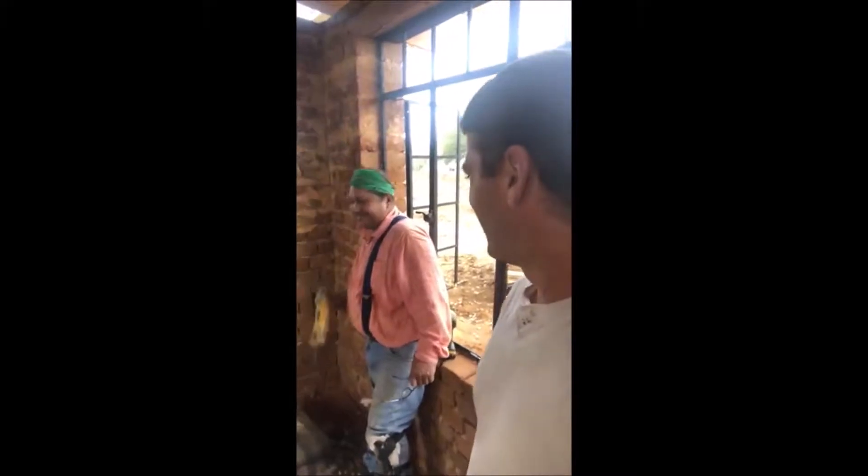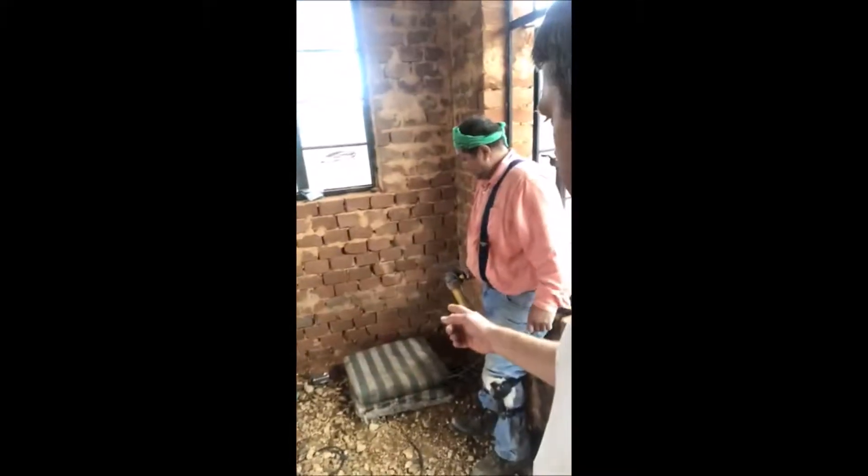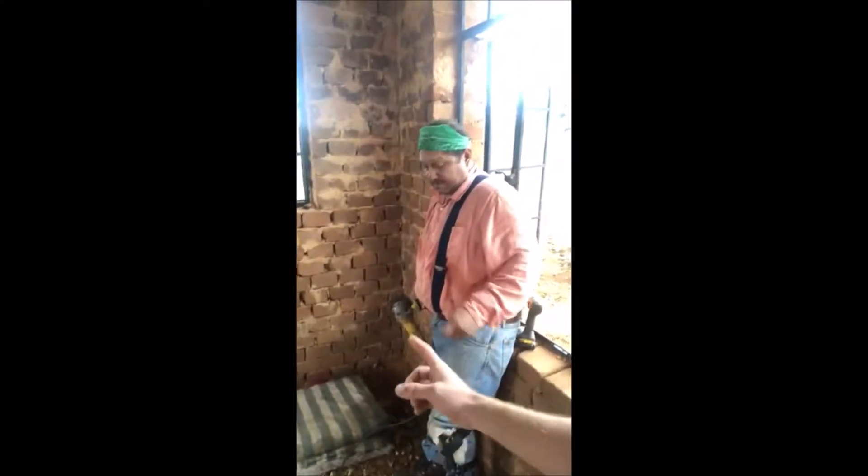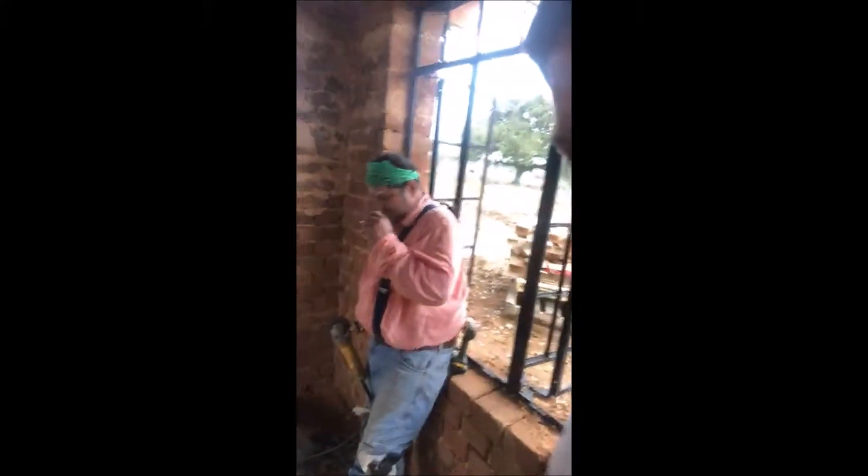Good morning, this is Ryan Runge, President of AECC. We are running in some electric wires today and a lot of customers have questions about how you do that with the earth block walls, so we got Robert here putting in the electric lines today. He's got an angle grinder with a masonry blade and we've got stabilized blocks here, so they're pretty hard, but with the angle grinder he's able to notch out the spot for the wire and for the box itself, so we'll watch him do it now.